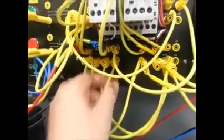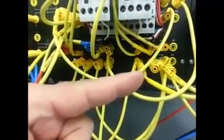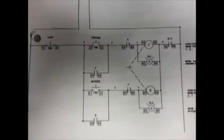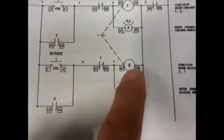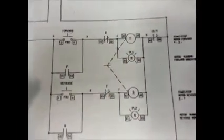From the other side of the coil I will go to the overload contact on the overload. Once you've completed the forward section of your diagram you will then repeat the process with the reverse push button, which is hooked up in series with the normally closed contact which allows the reversing coil to come on. Now that we've completed all the control diagrams, the only thing that we haven't hooked up are these pilot lights to indicate when the reversing coil comes on or when the forward coil comes on. This is a good indicator to let us know which way the motor is running.